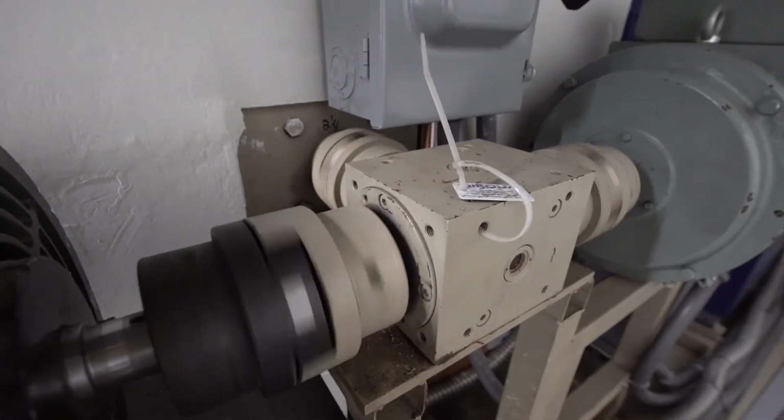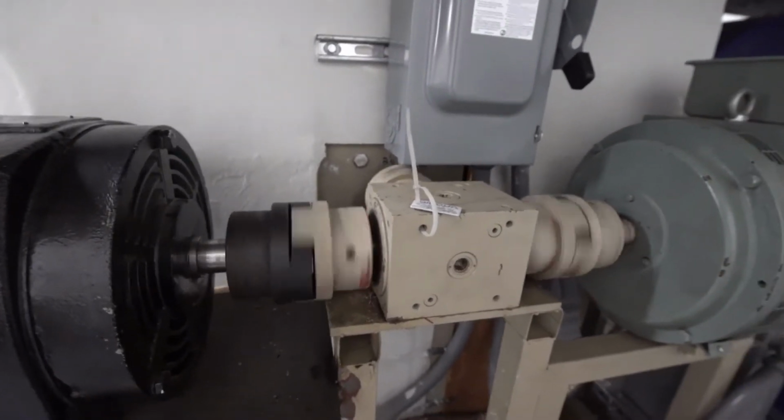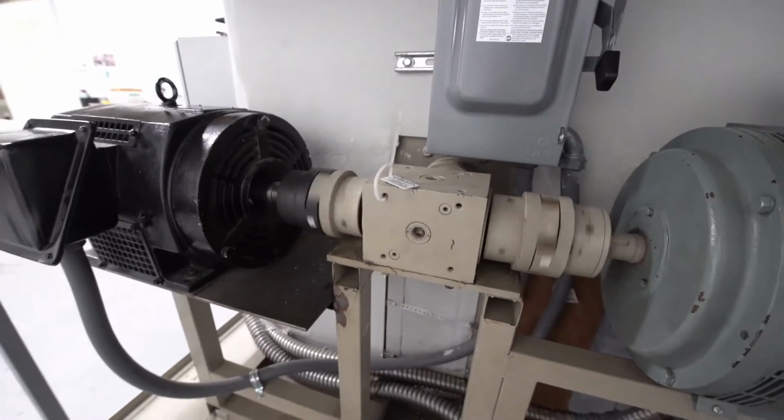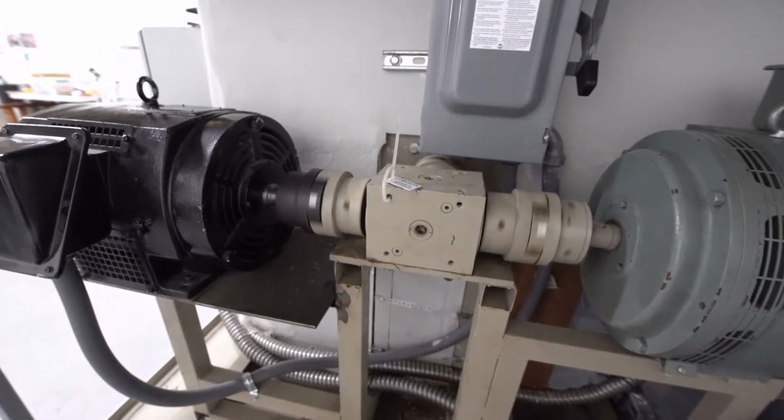The power turbine is connected to a center shaft, which is connected to a gearbox. The synthetic oil in the gearbox needs to be changed once a year. This 15-minute oil change is the only time that the JouleBox needs to be turned off each year. All other maintenance can be done while it continues to run.